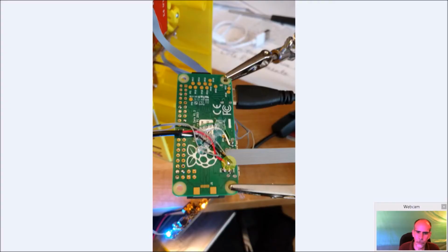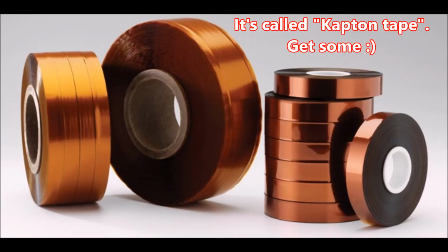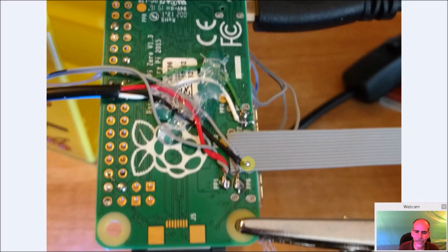And just back real quick, I put this cable in here just to make sure I didn't short anything. You should put some of this special tape. It's like Teflon tape or something like that. It's a special heat resistant tape that's non-conductive, and you can put it down and make sure that the pads are protected and nothing can short out. And I'll put that in the description as well. So that was here just to make sure when I powered it, it didn't hit anything and short anything out.